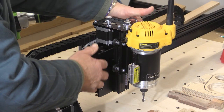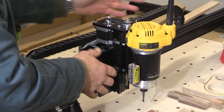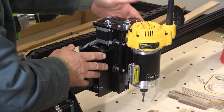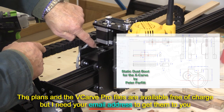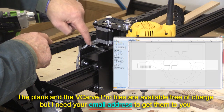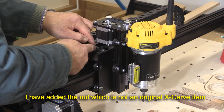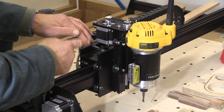In order to provide a framework for fixing the new type of dust boot, I didn't actually want to drill any holes in this part of the X-Carve. So to avoid that, here is a screw which I've replaced with a longer one, used to hold the stepper motor in at the back. I've also replaced the equivalent screw on the other side. By using longer screws there, it's given me a place where I can establish a fixing.